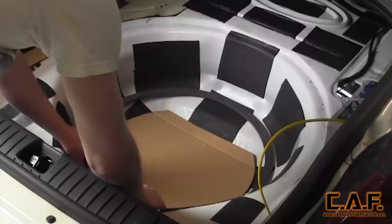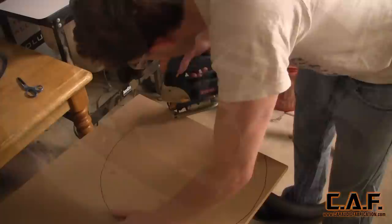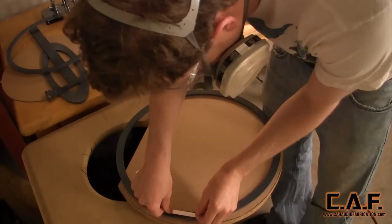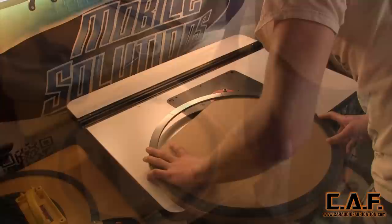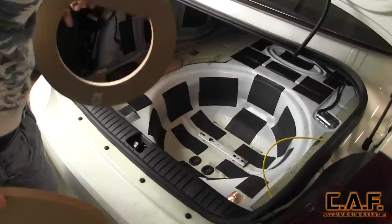Here I've cut the cardboard into a circle shape with one side cut off. This first circle serves as sort of a spacer, allowing me to put a larger circle on top so that I have more surface area for mounting. I plan things out with cardboard first so I have a rough idea of what I need to do with my wood. With a plan in place, I transfer the cardboard shape to a piece of wood and start rough cutting. Next I use template tape to stick a Mobile Solution smart template to my shape, which allows me to use a flush trim bit on a router to create the perfect shape. I then use this same process to remove some inside material from the bottom ring in order to save weight.